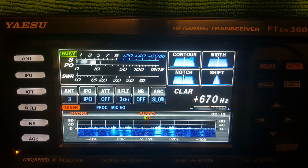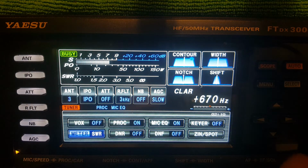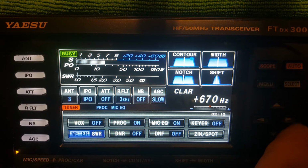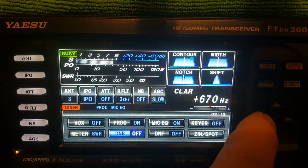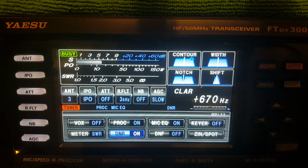I've got this window line and it's junk. It's got probably 8 splices in it. I'm not really sure what shape it's in. I know it measured a little high on the DC resistance test that I did when I had the V as a complete loop. And of course I had each leg here, but it was higher resistance than it should have been based on what I had for wire and lengths of open wire. So if you're going to replace that, that might be some of it too. But anyway, we'll see how it goes.